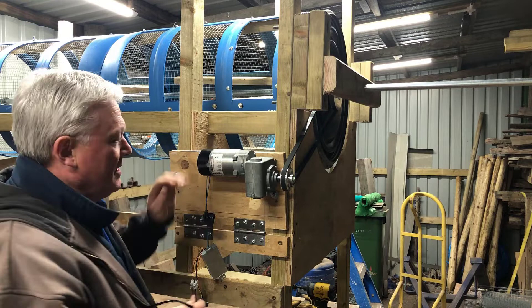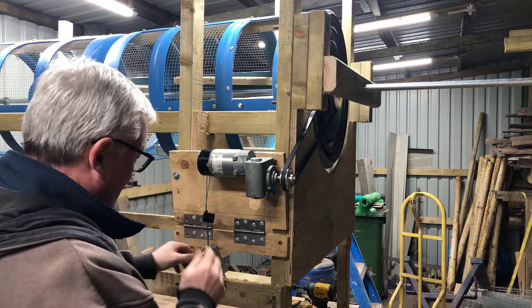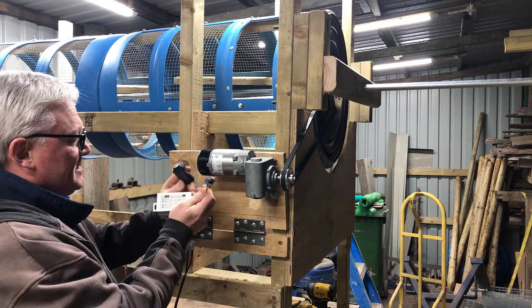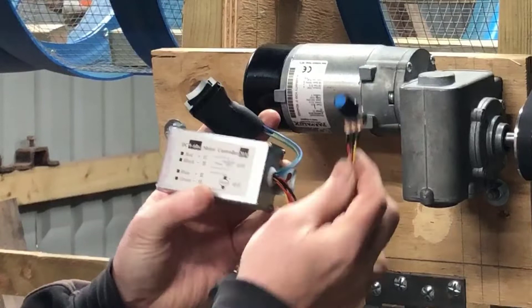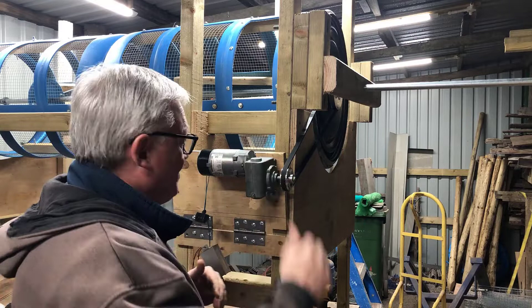The beauty of 12-volt DC motors - and I'm not saying you can't do it with other motors - is it's easier. If you buy one of these speed controllers - here's one - it's got an on/off switch and a speed dial. You adjust the speed by adjusting the voltage, and if you reduce the voltage it'll run at a lower speed. Perfect.